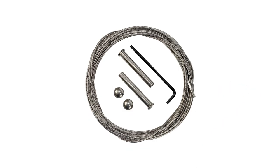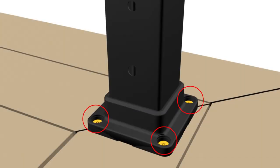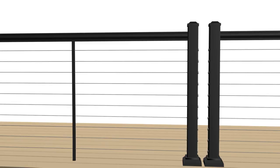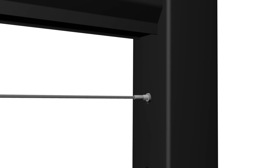Next, we'll install the horizontal stainless steel cables. Insert the threaded receiver fittings into the post. Note: if the end post was installed too close to a house wall, it may be necessary to loosen post anchor bolts. Plan so that the threaded receiver fittings are at the starting point and the fast fitting receivers are at the bottom of the stair run. Cable runs cannot be longer than 60 feet; if the railing is longer, an end post will need to be used to finish and start a new cable run. Thread the male swaged cable stud, attached to the cable, into the threaded receiver fitting and turn three to four complete turns — about one half of the stud into the fitting.